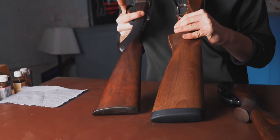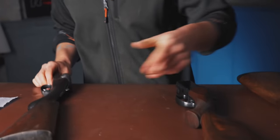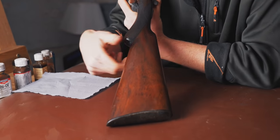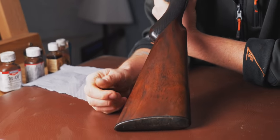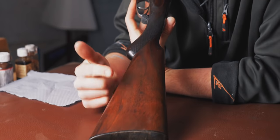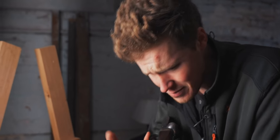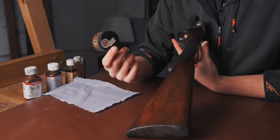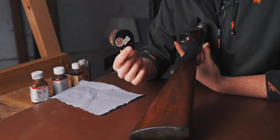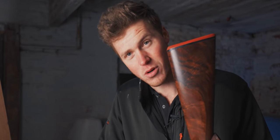Enhancing a piece of wood like a Beretta is very similar to enhancing an older oil finish gun. The first thing I do with an older oil finish gun is hit it back with 0000 steel wool to remove any muck and nastiness. Then, because the grain is still nicely filled from the work someone put in perhaps a hundred years ago, you can go over it with a finishing oil — True Oil or any conditioning oil. Even a conditioning oil followed by burnishing cream works well: the burnishing cream polishes and leaves a very thin waxy layer on top, giving a good London finish.